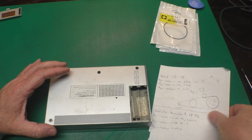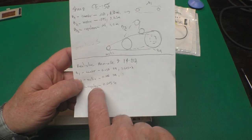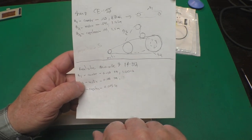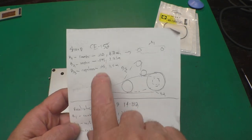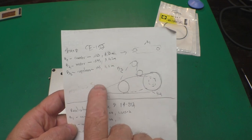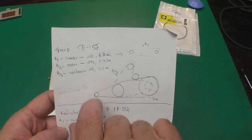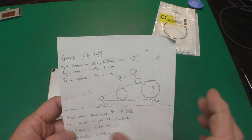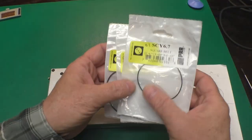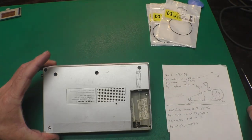Now, what I did when I took these apart, for the Minisette, I actually found belt lengths listed somewhere on the internet, so that saved a little bit of time, but I went ahead and measured the cross section so I had something to compare. For the Sharp, I took it apart and I made a drawing of how the belts were routed. I photographed both of these, and then I actually cut the belts off so I could measure the length and take into account how much they might have stretched with time. And I've got my belts here. I'll put a list of these belts in the description below in case you want to work on one of these.